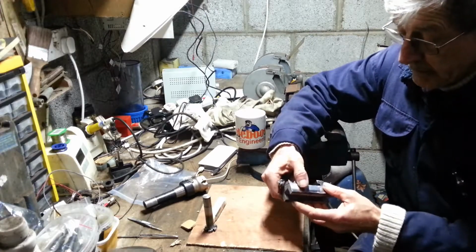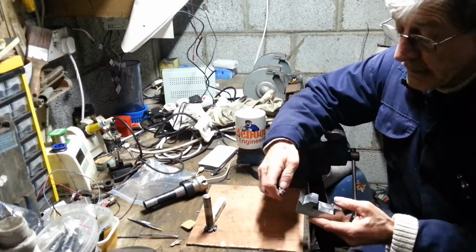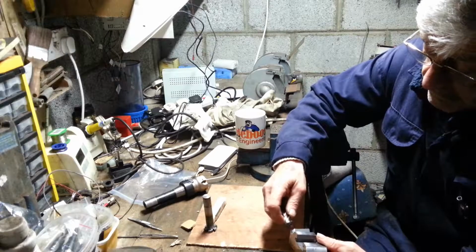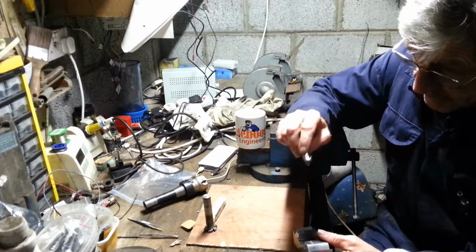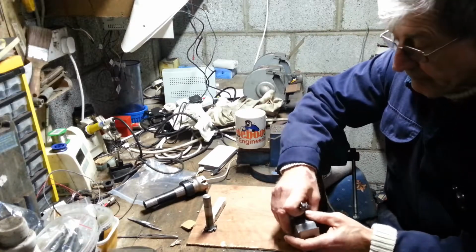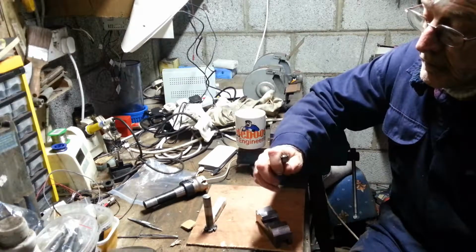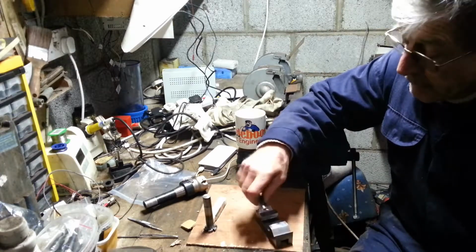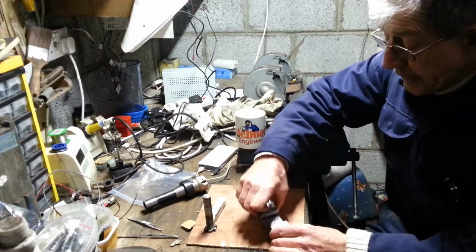So I took all that, cleaned it off, took all this out, took these out, and on the last one it grabbed up here. I think I'd gone in 8 millimeters down and about 4 millimeters in. I thought I'd be okay, but it grabbed and totally lost one flute and lost a bit more than half of another one. However, it did finish the job. I did finish it off, even though there were just a couple of runs left in it.